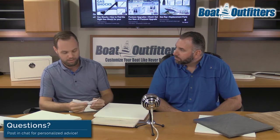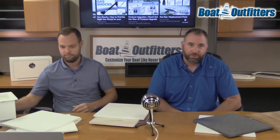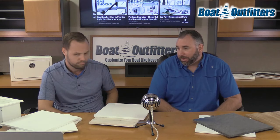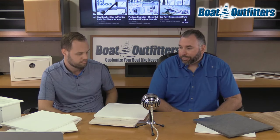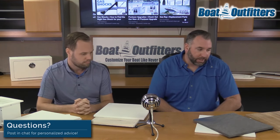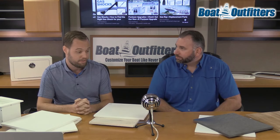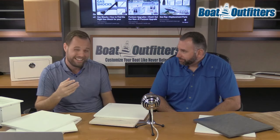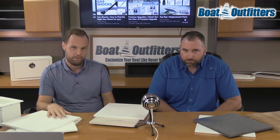Next question: I'm replacing a wooden bench seat in an old Whaler and would like a material that will last forever. For the 'forever' comment — teak or wood, well-maintained, could last forever, but if you're not maintaining it, it won't. We actually sell a kit developed for a 13-foot Whaler made out of Starboard. If you're spanning that distance you need some form of a stiffener. My recommendation would be Starboard. Going back to wood is always an option and gives it a vintage look, but there's added maintenance. The rigidity issue with Starboard means you need a stiffener, or alternatively Kusa board painted with tough coat.